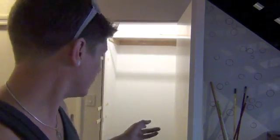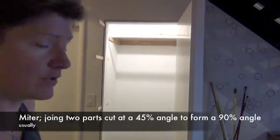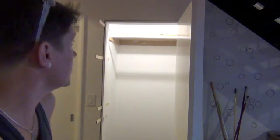Alright, I'm happy with where the door is right now. I'm going to actually attach it with more nails. You can use screws. I'm going to get the stop, which looks like it's installed about 1 3/8 back from the jamb. So I'm going to cut that with a miter in the corners, get it on all 3 sides, put that on with some smaller brad nails, and cut my trim, miter that in the corners.